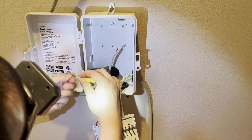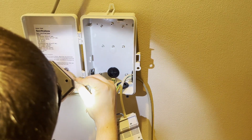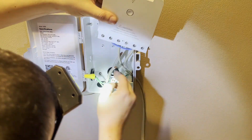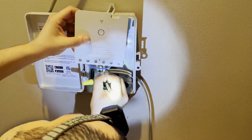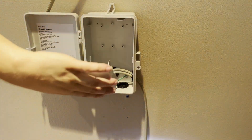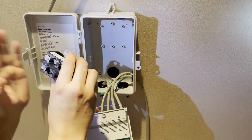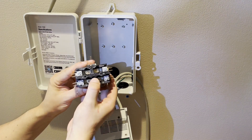Let's do the next one. I'm going to fold these as well. Make sure the wires look intact because the less copper you have, the higher your effective resistance — it's harder to transfer current and you'll end up starving whatever appliance you have hooked up. This is normally open one. The reason I got this timer is because I tried to use 120 volt coil contactors, and the problem is when you're using those with a smart switch, it doesn't give the right wave to the coil.